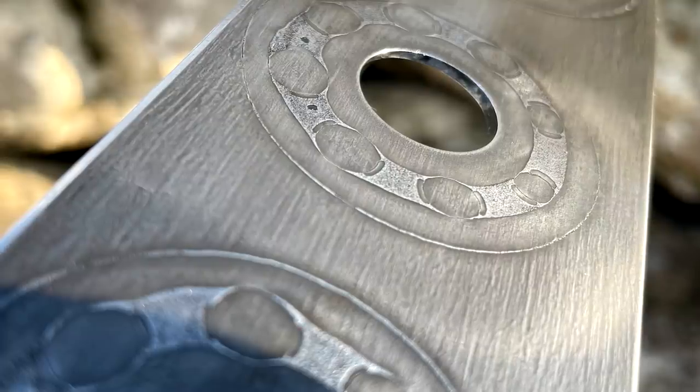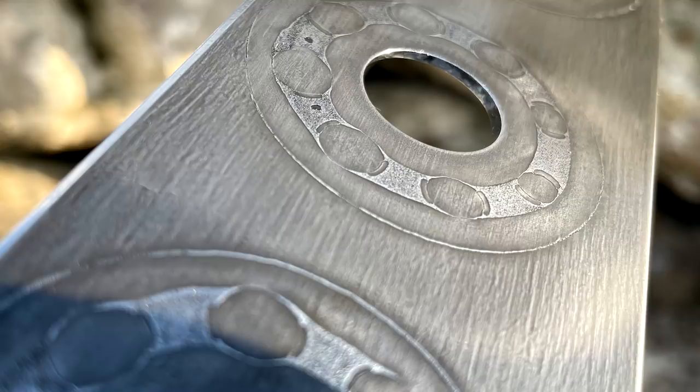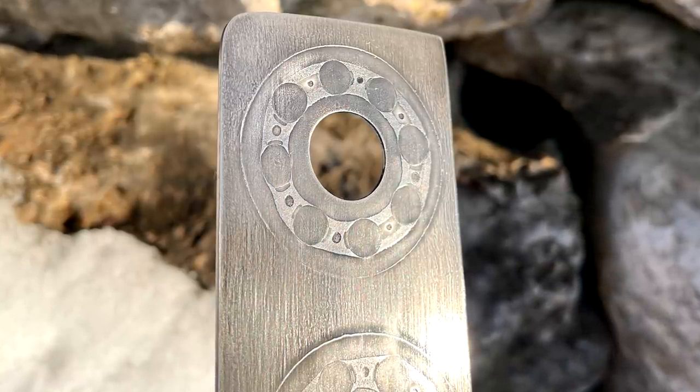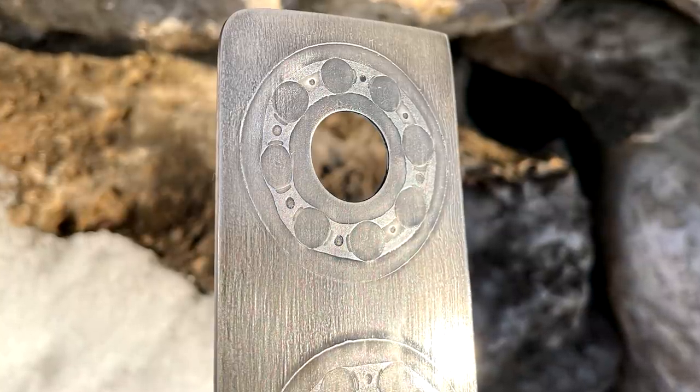It's very streaky, which I didn't like at first. I polished it entirely with 1000 grit sandpaper, thinking that those were 320 grit sandpaper marks, and then I etched it again and they came right back. So to one degree or another, I'm thinking some of those marks are from sandpaper, maybe just uber-etched sandpaper, and some of them are probably just part of the steel.